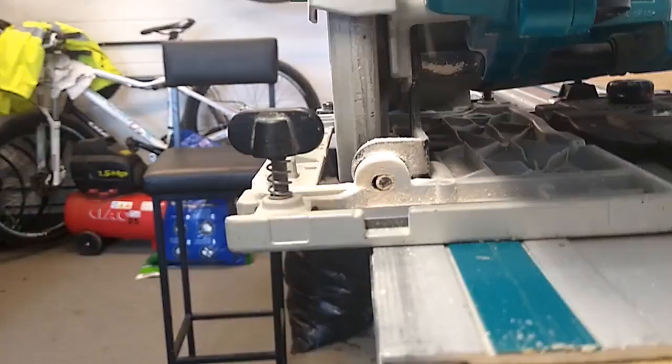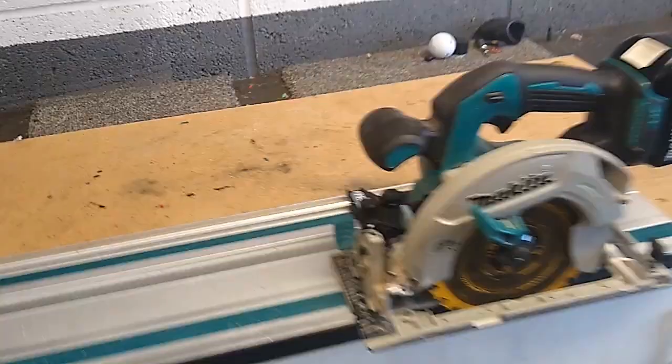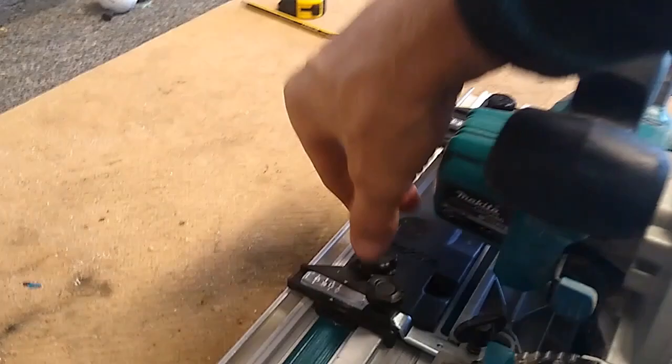That is now at one with the saw. It's got a couple of adjusters — one at the back and one at the front — and they adjust out any slack in the rail. When it's on the rail I've adjusted that and it's nice and solid. You adjust the whole thing so that the blade just catches the side of that rubber sacrificial strip.